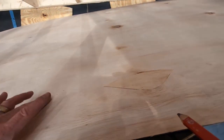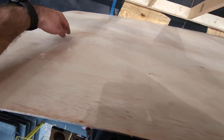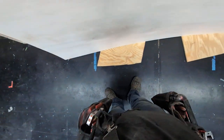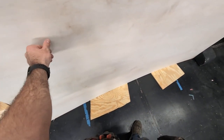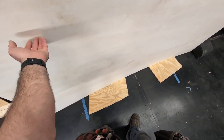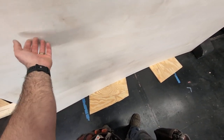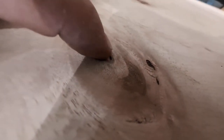You'll notice the B side is going in with the knot holes. There's a football fill for you, or a similar type of fill. There's another few. That's where they got real bad, and this is where they're not so bad, but I don't even know why they're bothering with a fill. Oh, you know why? Because this is underlayment. So they physically want that to be supported. So despite the fact that this side is the beauty side up, you don't want a void that ends up getting stepped on over and over again underneath the finished floor, and then you end up with a crack in your click together floating floor, or a crack in your linoleum that ends up collecting dirt, and then it won't come clean, all because of the missing material in a bad knot of a certain size.